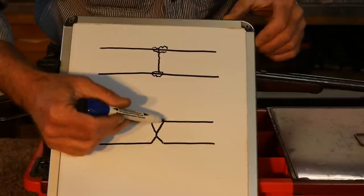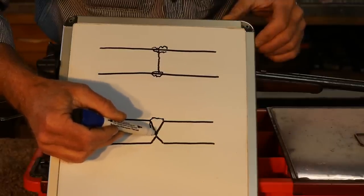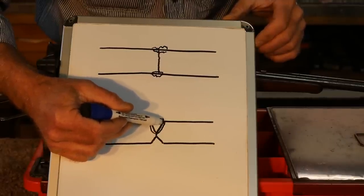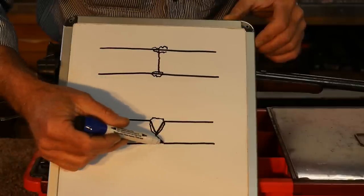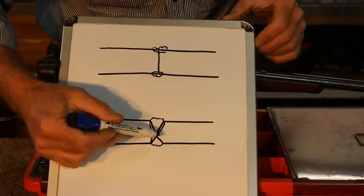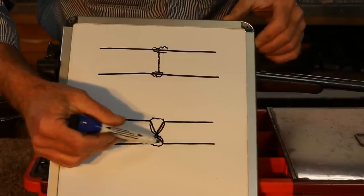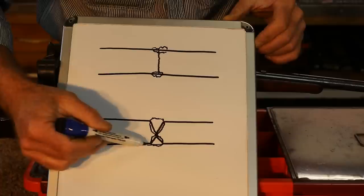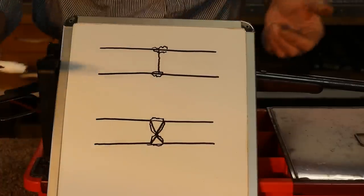So we're going to go in here, we're going to weld over the top here, and of course we're going to get some penetration of that molten pool all the way down like this, about halfway through that hopefully, and then we'll go down and weld this here, and again we'll get some penetration, so that should take care of the entire crack top to bottom. Then we'll go back in, we'll draw file or grind this off, polish it up, and re-blue it.